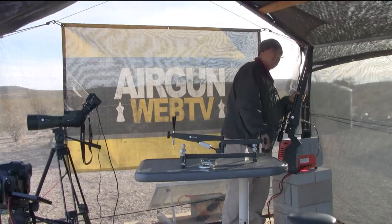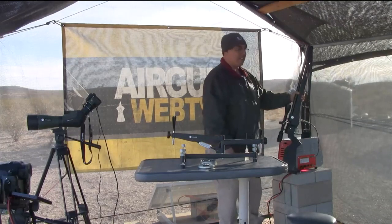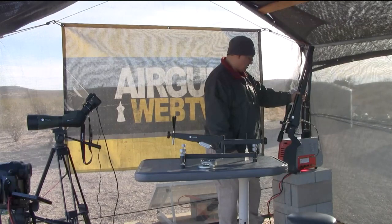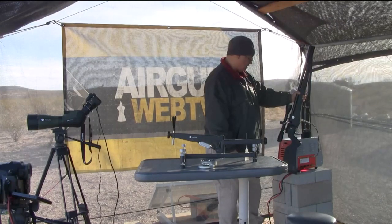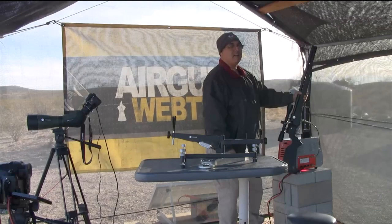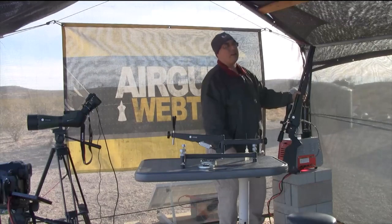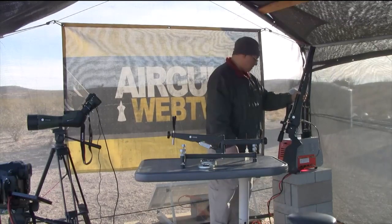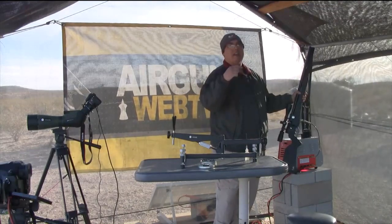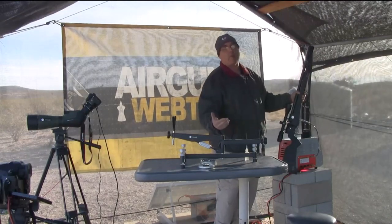They just went off. I can hear them. There they go. I don't know if everyone can hear that or not. But all that noise, as annoying as it is to me personally, is a great safety feature. We're at 2600 PSI. Okay. Yeah, she's moving right along. So it is relatively slow on the fill. Yeah. But it's got that heat cutoff and the fans that kick on to prevent it from burning itself up.